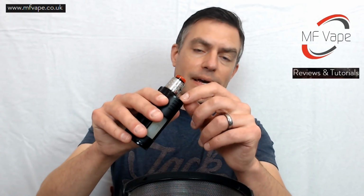managing to find its way. It must have been round the edges, because I was actually noticing, when I opened up the door on the bottom, it was a little bit wet inside. So you do need to be careful that you're actually filling directly into those holes and not just round the edges, because it will tend to find its way down. So yeah, that's just something that you've got to watch out for.